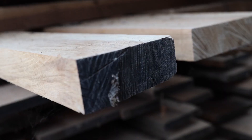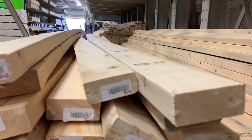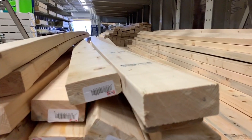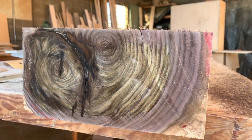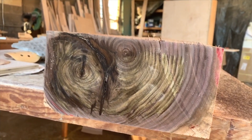The quality of lumber coming out of this thing is bar none way higher than anything you're going to get on the shelf. Solar kiln drying releases moisture slowly, drastically reducing lumber defects and case hardening, yielding a much higher quality and quantity of usable lumber. This thing dries lumber really well during the day, and at night it has a chance to absorb some of that moisture back and settle. So it's not suddenly stressed out and case hardened to where when you rip it in half on a table saw it splits open from all that tension.